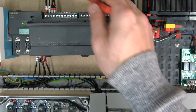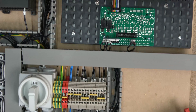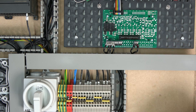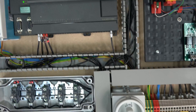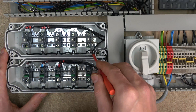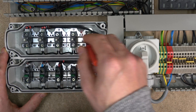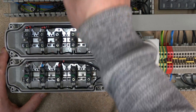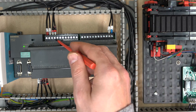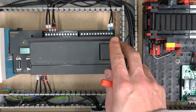You can link the power supply across to make sure the second bank is powered as well. Every time the transistor output comes on, it will send a 24V signal out. As you can see, I have inputs from my board for run forward and run reverse, plus lights. The neutral goes to my lamps, and they receive 24V signals from the transistor outputs, which turns the lamps on.